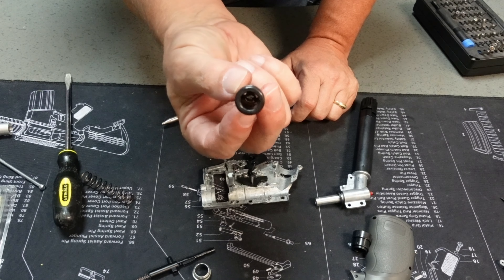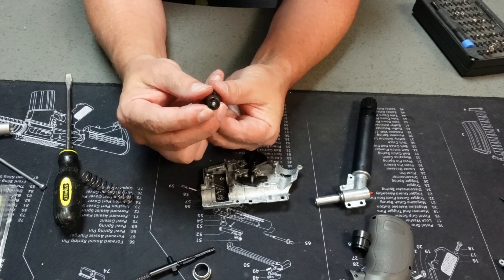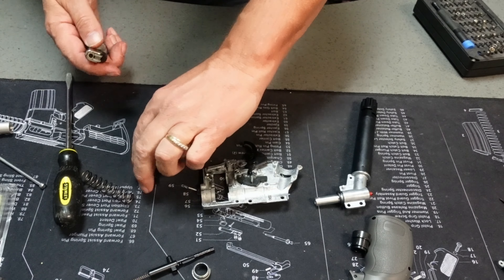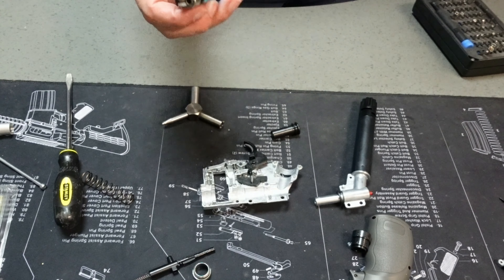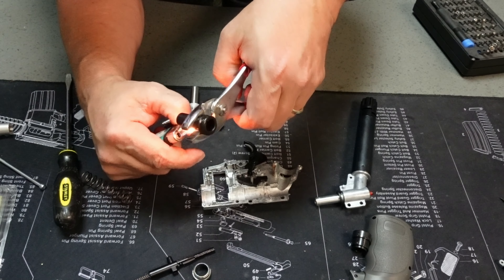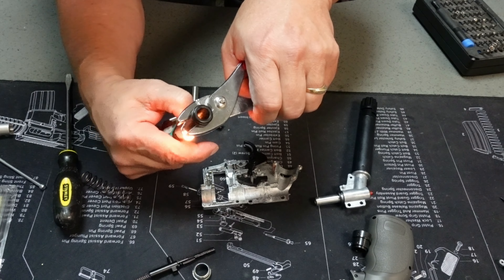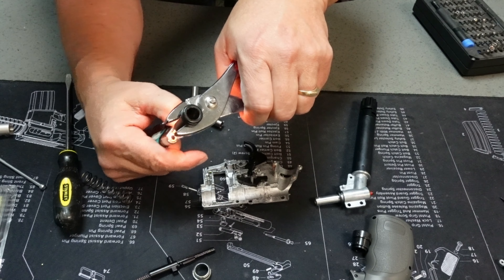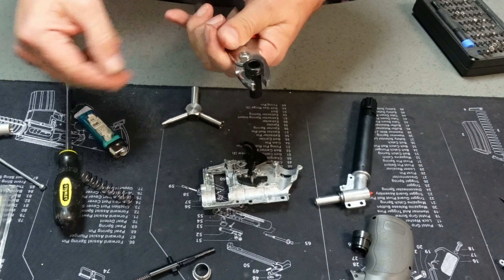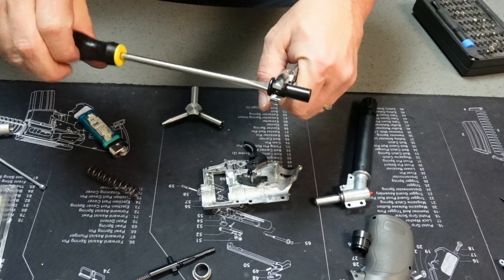Before we put the bolt back on, we're going to change out that firing pin. To get that firing pin — this is something a lot of people have asked about — it's held in with a pretty heavy-duty adhesive. I normally use a heat gun, but I know a lot of people don't have heat guns, so I'm going to use a standard lighter and a pair of pliers to hold this into place. I'm going to heat up the bottom here a little bit from a distance — you see the distance I'm using — and heat it up just enough to where it loosens up that adhesive. Notice I'm moving and not stopping with direct heat. Once you've got it warm enough, take your flat-tip screwdriver, put it down in there. This is some seriously soft metal, but it loosened up enough to where it comes right out.